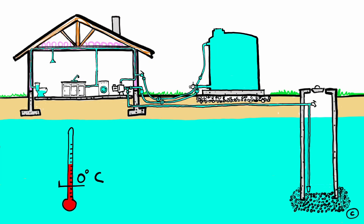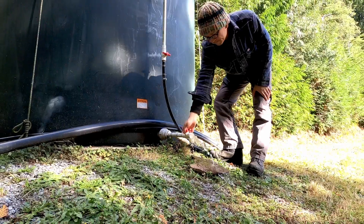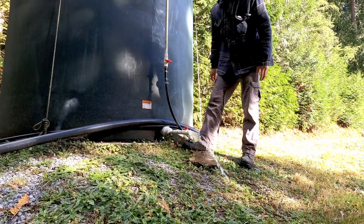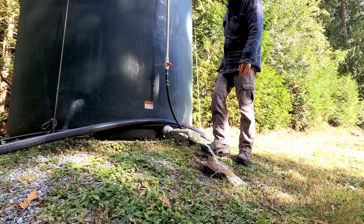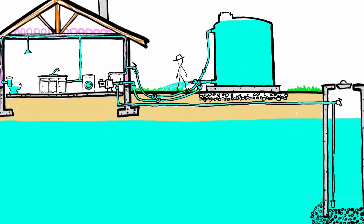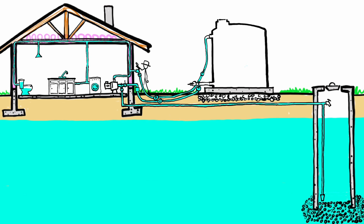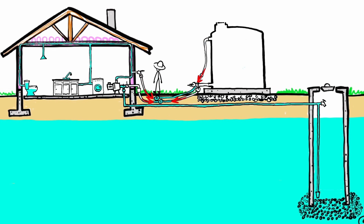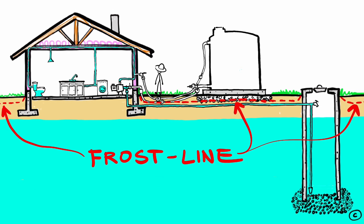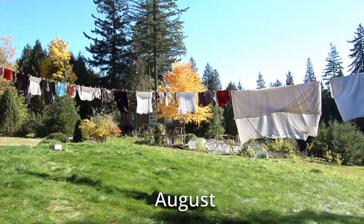When the weather gets cold, it's time to drain the system so the pipes will not have a chance to burst from ice. I let the water out slowly so it doesn't make the ground muddy and wet. A big tank like this takes a good half day to drain. I also drain all the hoses and pipes, as they are all above the frost line. Luckily, I already have a valve installed at the lowest spot of each one. When the next dry season comes, I know I will not run out of water again.